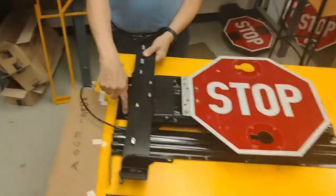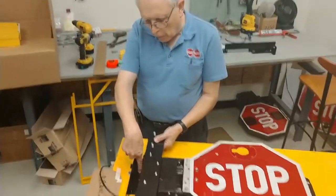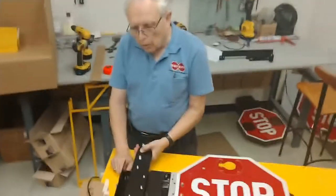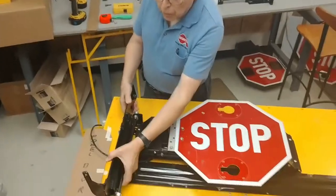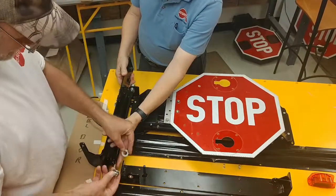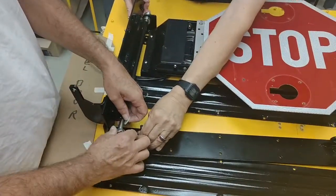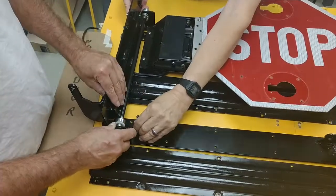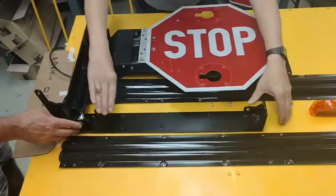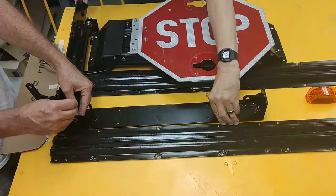There are three support places here. You can anchor with either sheet metal screws or nutserts. We prefer to put a nutsert in at least the top one, and then two one-inch number 12 sheet metal self-tapping screws. Next goes on the lower bracket support — it comes with a nylon washer on first, then the bearing, so it stays in position. This supports the frame when in operation, and it will end up approximately right at the top of the rib — in fact, exactly there.